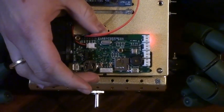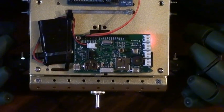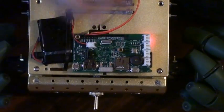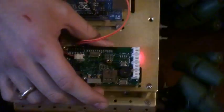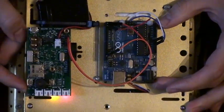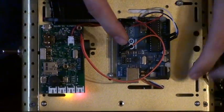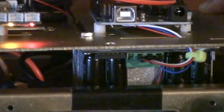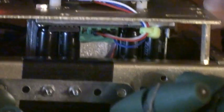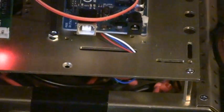It is optimized for Bluetooth, specifically with a Windows Phone 8, which is what we're using, but it has some other nice features that make it good for our class. It is then speaking with an Arduino Uno that you can see here, which reads the serial data coming over Bluetooth and then speaks serial to the motor controller board down in there — it is a Sabertooth 60-amp regenerative motor board that is a two-channel board able to drive opposite sets of wheels.